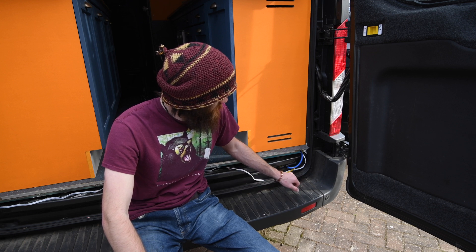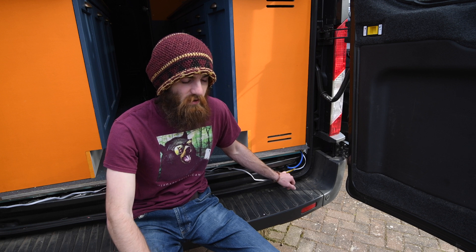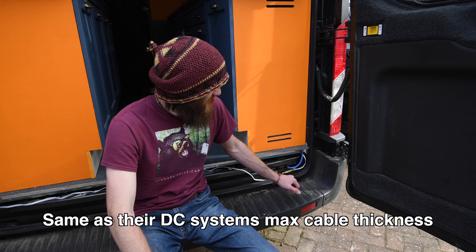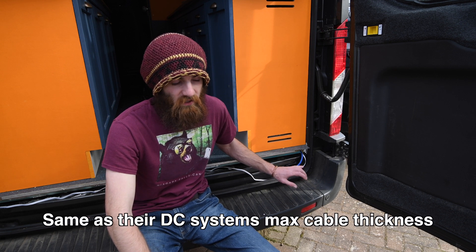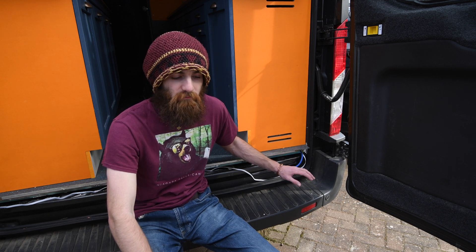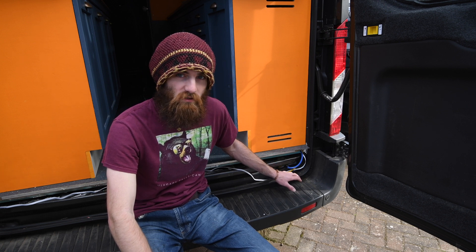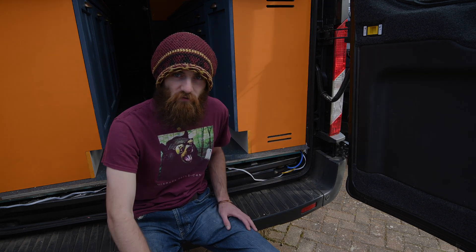One thing I forgot to mention was the thickness of the cable. I went for 10mm, which is way over-specified — 4mm or 6mm would have been absolutely fine. I went for 10mm because it was cheaper to use the lugs I already had for 10mm than to buy 6mm and buy more lugs. Whilst you will see some people using really thick cable like 50mm or the same thickness as their DC system, in the case of the MultiPlus there's no continuity between the DC aspects of the inverter and its case, so there's no need to have an equivalent size on that. But different inverters will be different.